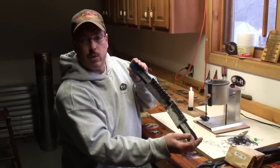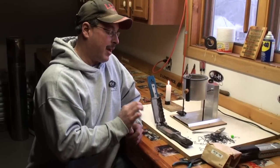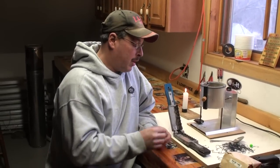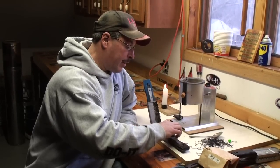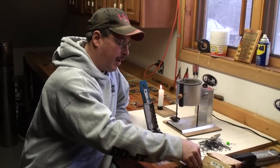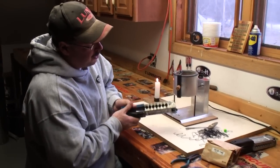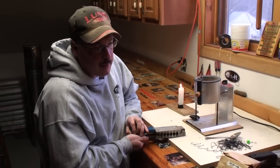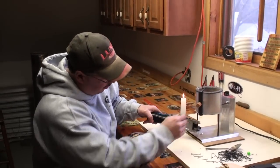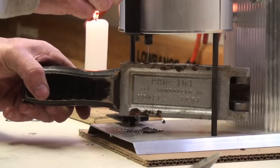This is an eighth-ounce Do-It mold, just a regular round head, and this is actually a 4/0 hook. This is definitely a specialty jig — there's not very many companies that even come close to making a 4/0 hook with an eighth-ounce jig. There are some things I did to this mold: you grind some areas out to fit more of the 4/0 hooks in there, but this particular mold is only going to hold three hooks at a time. Make sure when you close the jig mold you hear that little snap. If you don't hear that snap, the hook is going to be holding the mold open and you're not going to get a good pour. Even though I'm only pouring three at a time, it keeps the mold real warm that way.